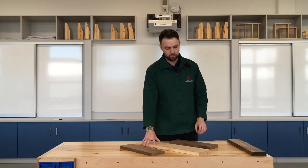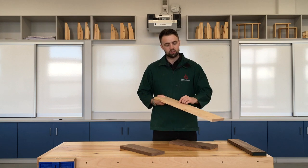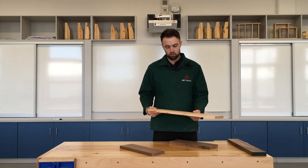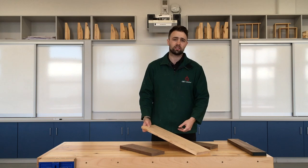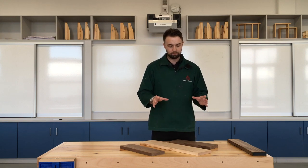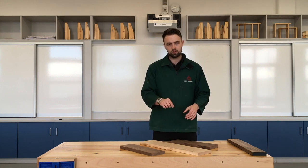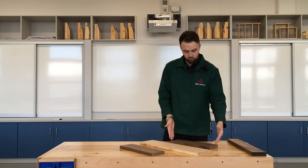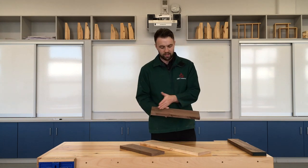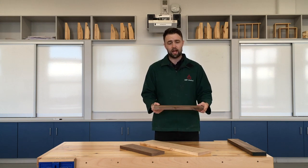I've got my two pieces of walnut and a big piece of maple here in the middle - about one inch. I'm going to cut a little strip out of that so we have our contrasting woods. The design follows the same layout I have on my Instagram from chopping boards I put up back in August: a large piece of walnut, a little strip of maple, a strip of walnut, a strip of maple, and then another larger piece of walnut. I want to keep the length between 360 and 380mm.